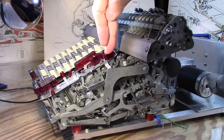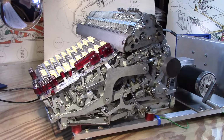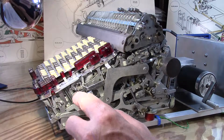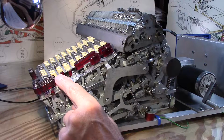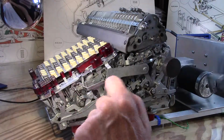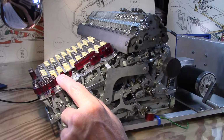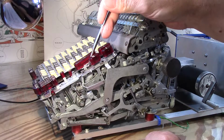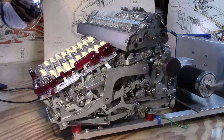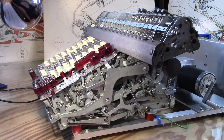Maybe it's one of those things where you work on this thing for months and you're not really sure what you did months ago. And this has been a few hours every few days, something like that. So anyway, when I was trying to get divide tab going, I noticed that even before I realized it had this stop right at the beginning of the first increment, it would never really work, and that was because the automatic mechanism wasn't pulling this key down firmly enough or quickly enough, compared to when I could just whack the button, as it were.